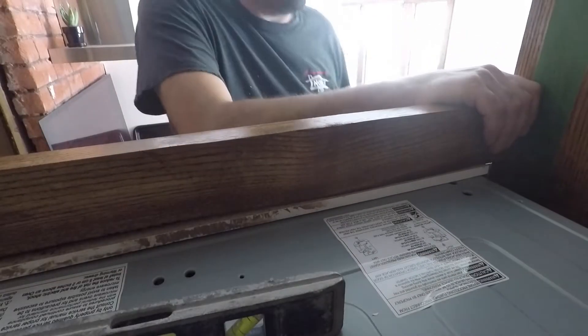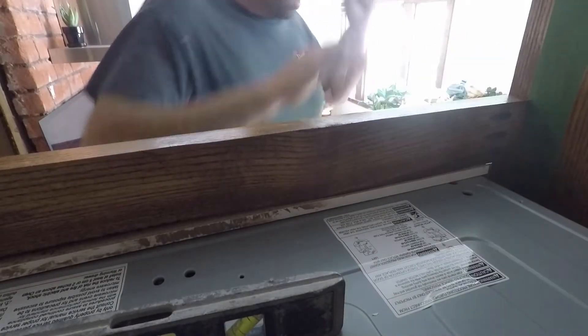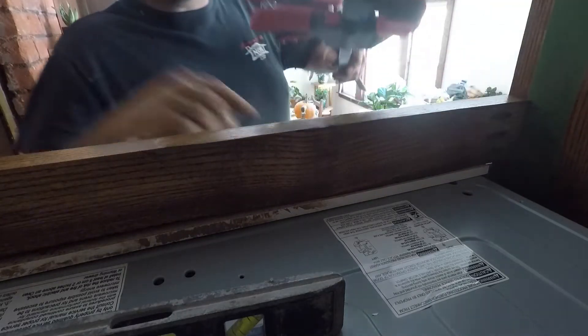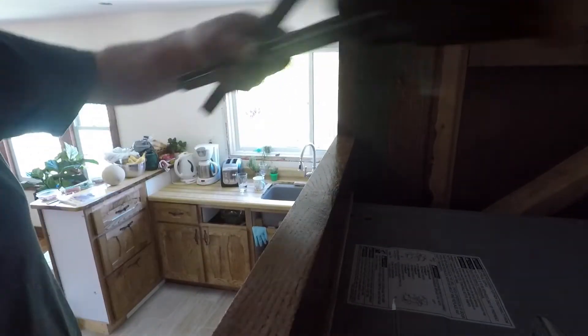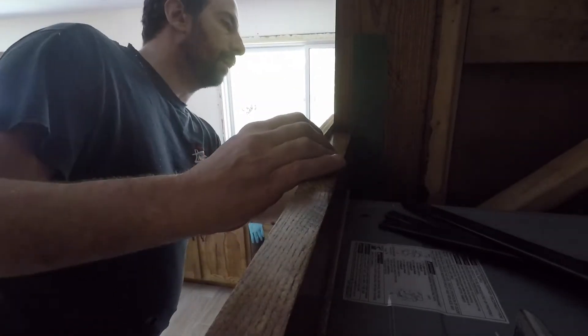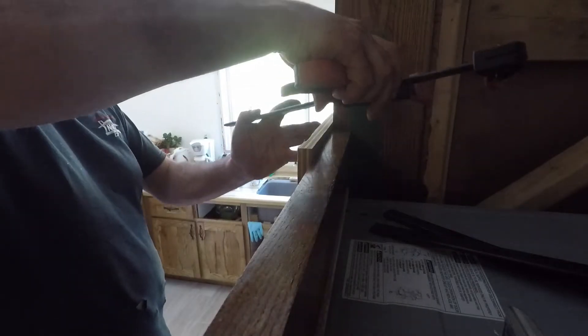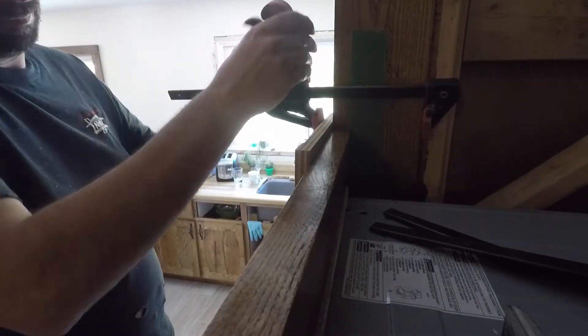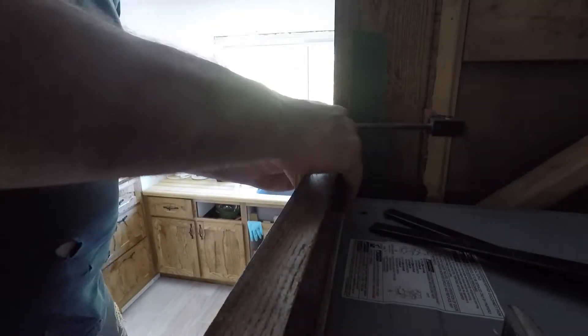To make this one go flat I'm going to try something — I want it to be flush. To attach this wood to the vertical beam I pre-drilled three pocket holes on both sides. To make sure it remains flush with the main beam I attach the plywood against it, and I attach the horizontal beam against the plywood.